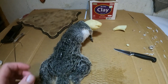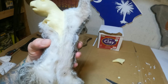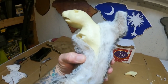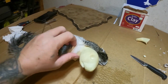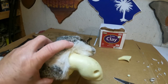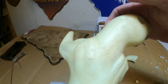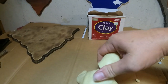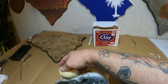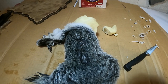Change of plans — I actually got it slid on without cutting the back legs or this front leg, and I can close that gap up, so I'm not worried about that. Instead of cutting off three legs, since I can't get the head to slide over — which is typical — what I'm going to do now is make one of those V cuts, break it, and cut the head off. I'd rather cut the head than do all the legs — that's less repair. I cut a V, removed the head, and now I'll slip the head inside, slip it back over the front leg, put the leg back in, test fit everything, and go from there.